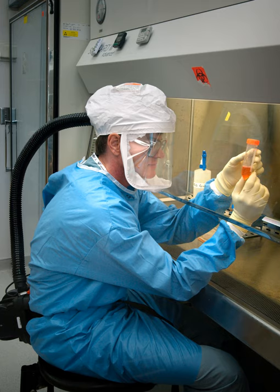This air is drawn, through ductwork, up the back of the cabinet where it is then blown into a positive pressure, contaminated plenum. Here, the air is either recirculated, through a HEPA filter, back down over the work zone, or exhausted out of the cabinet, also through a HEPA filter. Sizing of HEPA filters and an internal damper are used to balance these air volumes. This type is not safe for work with hazardous chemicals